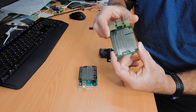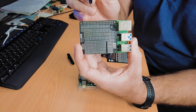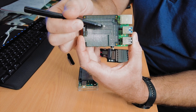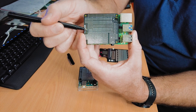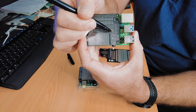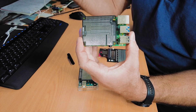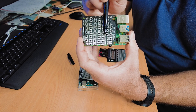For the Raspberry Pi adapter, around the top and right-hand edges of the protoboard all the GPIO pins are broken out, labeled with silkscreen numbering equal to the BCM pin numbering on the Raspberry Pi. In the middle there's a small area for DIP packages. On the right side there are power rails for convenience — the ground rail runs all the way across, and we have 5-volt and 3.3-volt rails broken out. There are also two slots cut so you can still connect camera and display cables to the Raspberry Pi underneath, and the remaining gaps are filled with gridded pads.